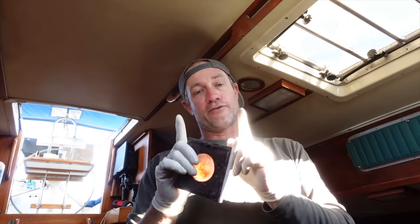A lot of the boat, like for instance hatches and that, what the hatches are screwed into is all tabbed fiberglass, so it's probably like 4 inches long and it's just straight solid glass before it hits any core. For some reason they didn't have it tabbed or have solid glass around where the chain was in and out. Maybe it was an afterthought, or maybe it was an add-on at a later date, different windlass, who knows. But that's what we're going to do. Stick this in, fill it up, grind it out, it'll be solid glass, the core's fixed, we should be good.